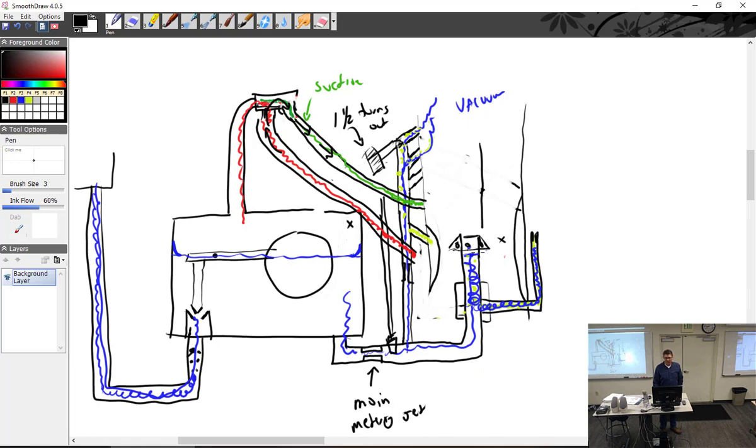ran leaner. Now, believe it or not, we could actually get to a point by sliding those little discs. That's how we can control it. A little more suction, a little less suction. We can get to a point where we can suck all of the red out, pretty much.